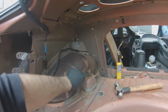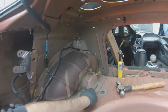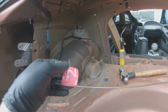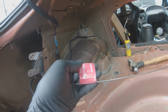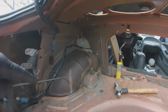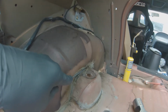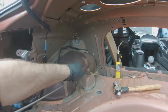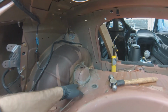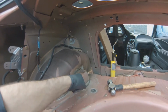And this is pretty thin metal. Of course, this is thicker. It's easy to burn through this. So what I get is this 1/8 inch round bar from like Home Depot, Lowe's, Ace Hardware, somewhere like that. And you can see, you can lay that in there and take up that gap and even put it around here. So it's easy not to burn through it.